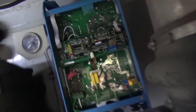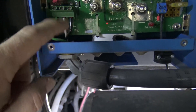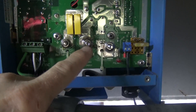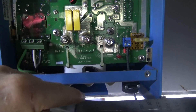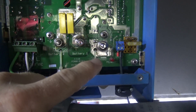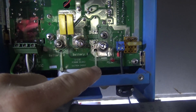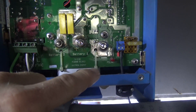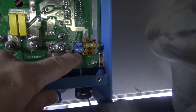If you recall in the previous video, we run AC power just to this here. What we'll do is put a positive leg and a positive leg out to the battery, and on this one here we'll put a negative leg out to the battery. We'll also add this trickle charger.